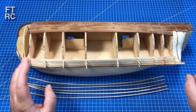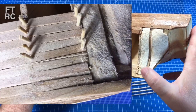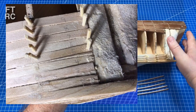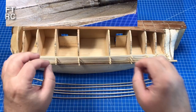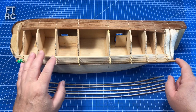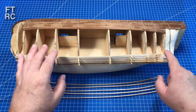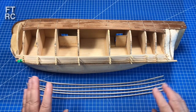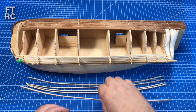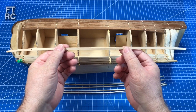So I've got to plank five now. I know I've got to plank five because I numbered the planks — I did that after I had bent them, put them on the frame and pinned them. I went through and numbered them at the keel runner so that when I pull them off I wouldn't get lost and confused. You end up with a whole lot of planks, but these are already bent into exactly the curve they need for that particular region.